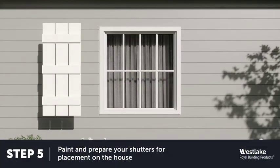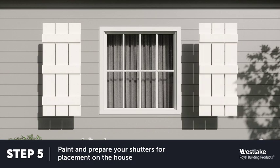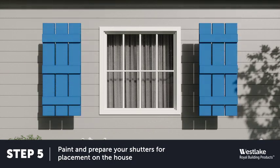Now you're ready to paint your new shutters with 100% acrylic latex in the color of your choice. For darker colors, especially dark blues, use a heat-reflective, formulated paint.